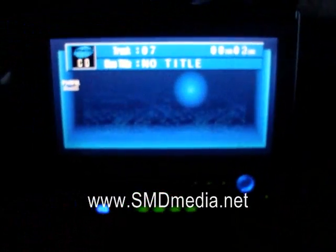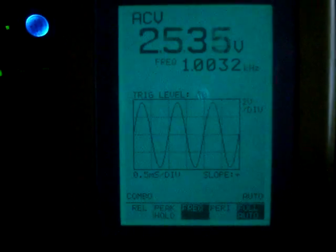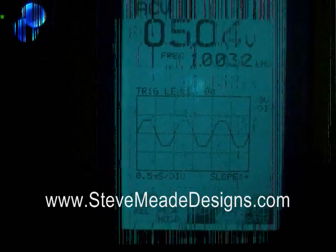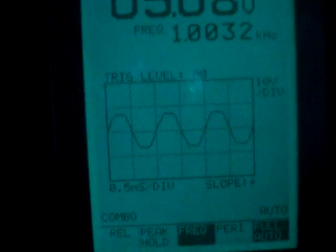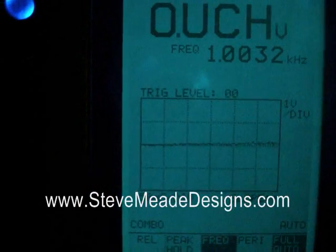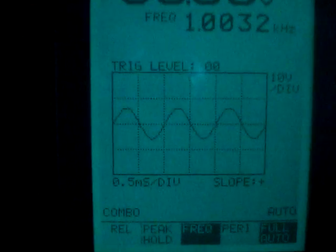I had to reset the track — put it on repeat if possible. I'm still turning it up: volume 45, 46, 47 — it's still not clipping off. All the way up to 58, it's nice and round. At 61, it looks like you can take this deck all the way to volume 61 out of 62, which really isn't that bad. At 62, this is what clipping looks like — the top is squared off. That's not good. You back it off just a little bit until you see it getting round again. You back it off until it's round, and then you know you can turn the deck up that high without hurting anything.